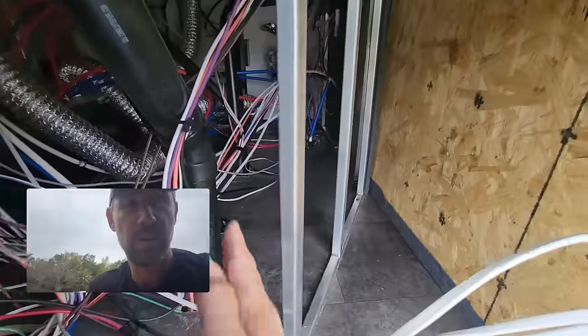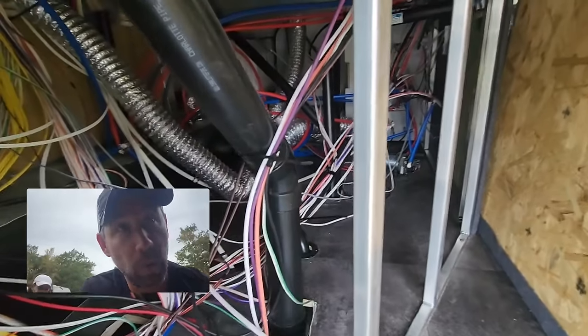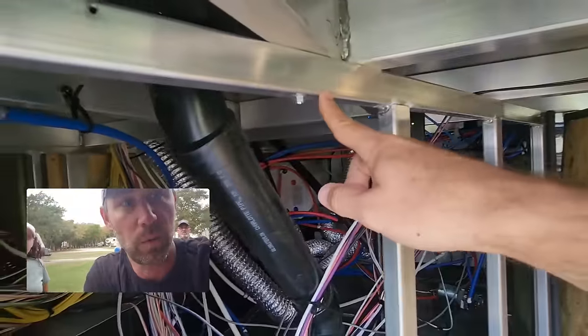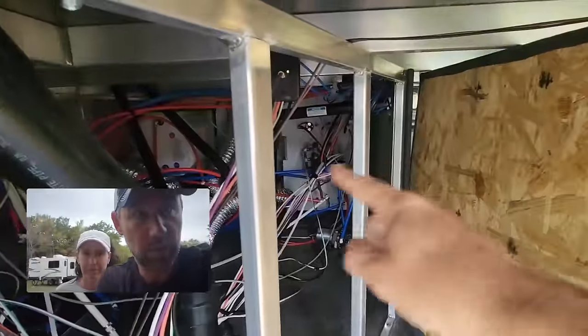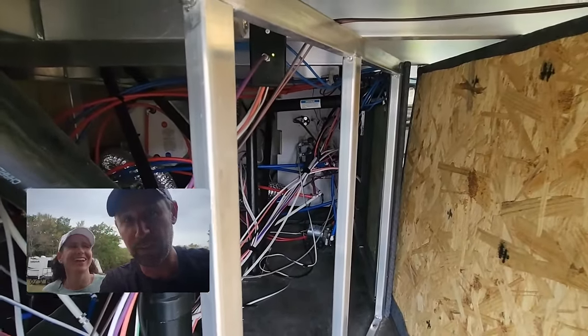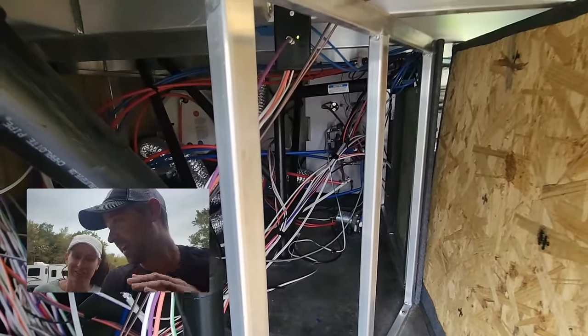Here's what it looks like behind the wall — there's the framing where it's framed out at that angle. We want to go this way and square it off. You can't go too far over because you have the plumbing for the toilet. We'll probably have to relocate the wiring over to the other side. It just has a couple of bolts, so it should be pretty easy to unbolt from the floor and shift it over and bolt it back down, but then you've got to build a frame for that other piece at the 90-degree angle.